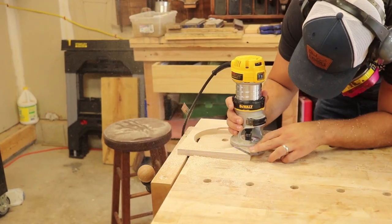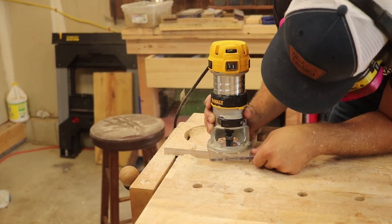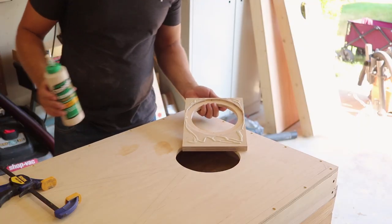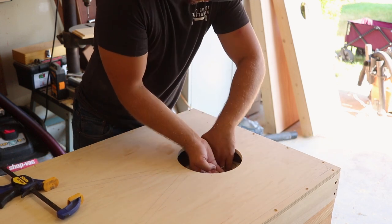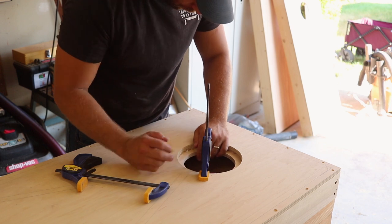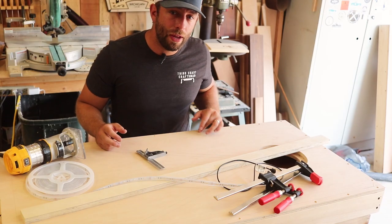For this set I cut out a hole in the top with a radius that is three-quarter inch wider than normal. Then I take some scrap wood, make a normal six-inch hole in it, and drop that underneath, gluing it in place. I had to route away some extra material on that scrap piece so that the LED strip has clearance when it's turned on its side.